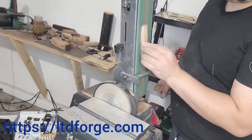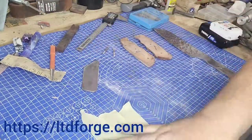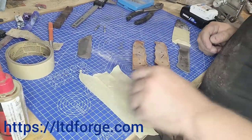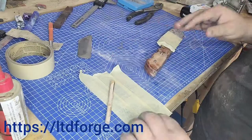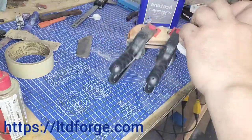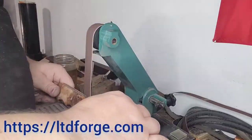I like to put it together with tape because it holds it together, and if you just glue tape to tape it pops right off, just like it did here. We're going to glue it up and tape up the top, making sure it butts up as close as possible. I'm using standard five-minute epoxy. My hands were all sticky so I had a shop hand help put it together. I've got acetone here and I'm wiping off all the extra little edges to give it a nice clean look, because after the epoxy dries it's a real pain to get off. Nipping off the nipples from the pins.